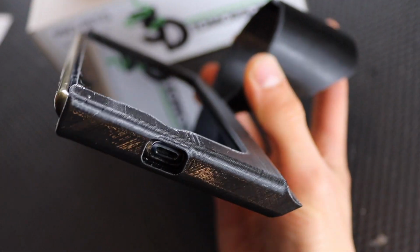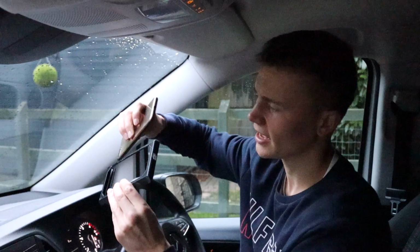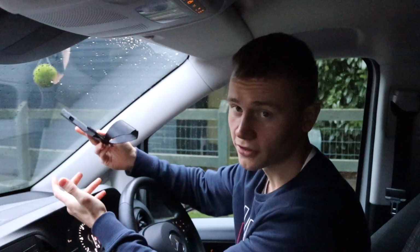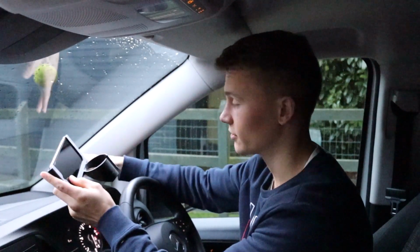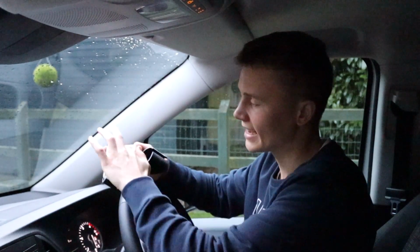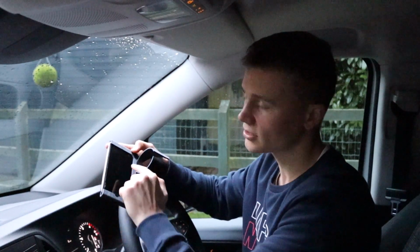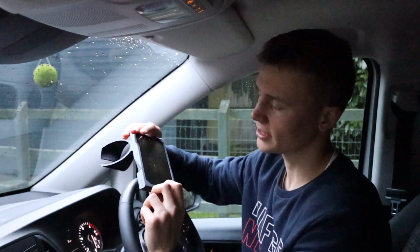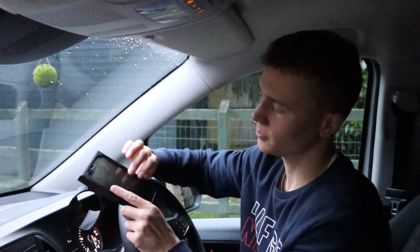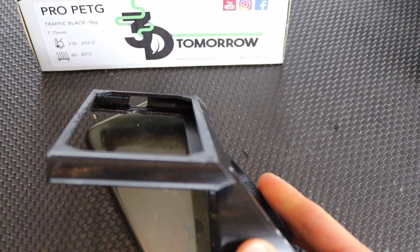I would still make a few tweaks because, as you can see, when you're pulling this out, your fingers get caught on this back bit, and there's no real need for that back bit to be in there at all. Another thing I would say is that it's quite hard to use the phone in the case itself. Not that you should be using it as you're driving, but if you do pick it up, when you're stopped of course, and start tapping away, it's still hard to get the edges, so it's hard to pull down, hard to push up, hard to hit the home button. So I'm gonna pull these edges back a bit more to give a little bit more room on the screen, and then increase the size of the back to give a bit more grip where I'm removing it from the front. Again, also removing this because it's not needed, and then I'll just be able to pull the phone in and out without getting stuck.